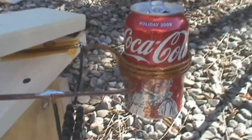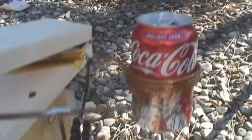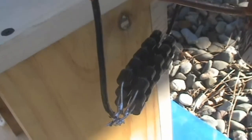And here is the work coil and the can. The coil is about 1.6 micro henrys. And this is a diode bank — hopefully it will catch any EMF from the coil. If my calculations are correct, this will either be destroyed and/or explode. So, let's start crushing cans.